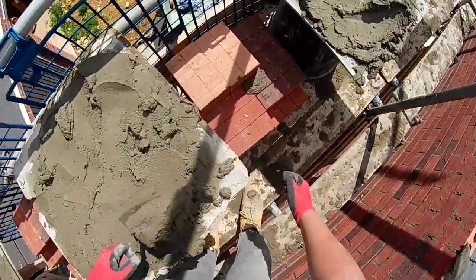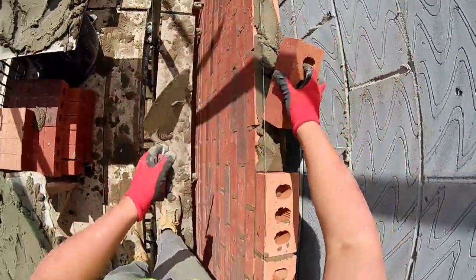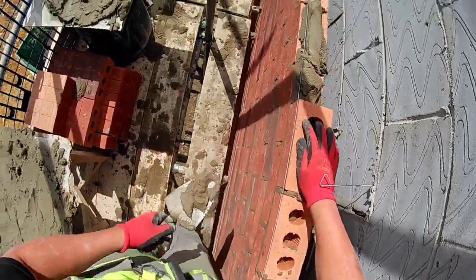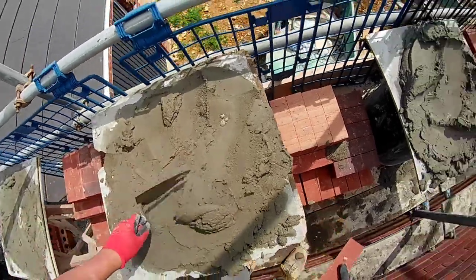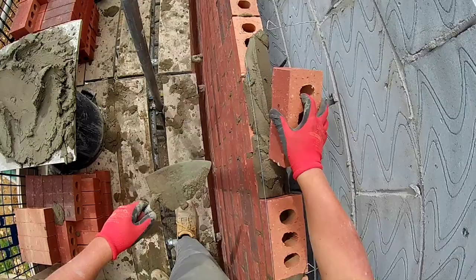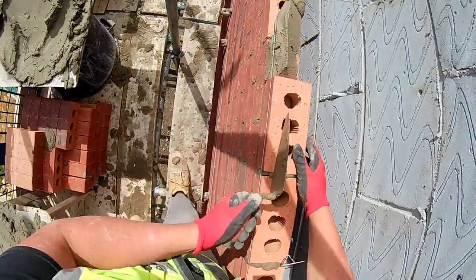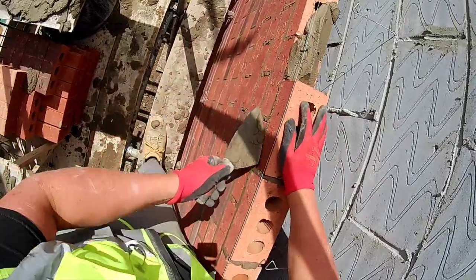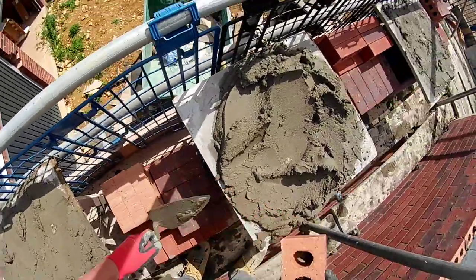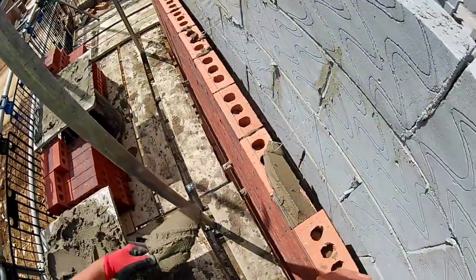It's good using this sort of trowel out of a tub. The swan neck trowels by Jung that the European guys use have handles designed with the angle of the handle arm to scoop out of a bucket or a tub, because they roll their mortar into a sausage or a pasty shape in the bucket and not on a board like we do.